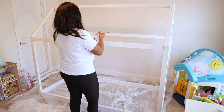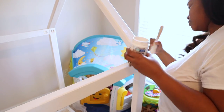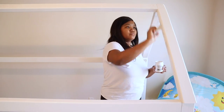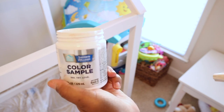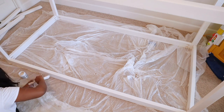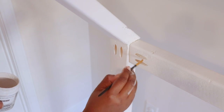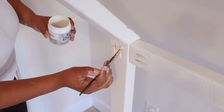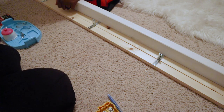The next day I came back and painted the bed. The four pieces that I recut, I primed those first, let them dry, then painted everything Sherwin Williams White Cottage. Where I had my pocket holes I took a smaller paintbrush and painted those areas in so that when we move it'll be easier to take those screws out and disassemble the bed.